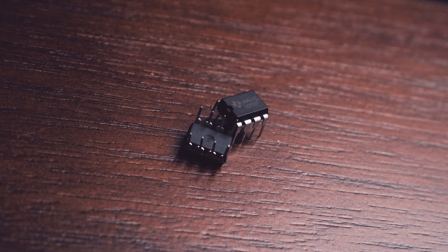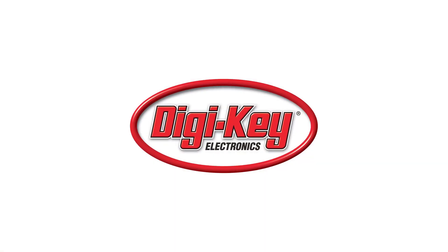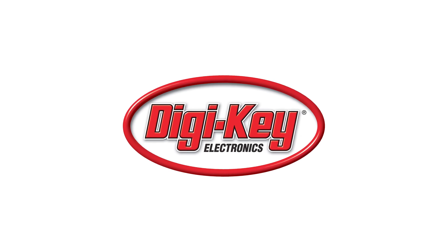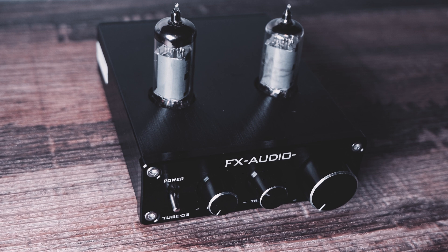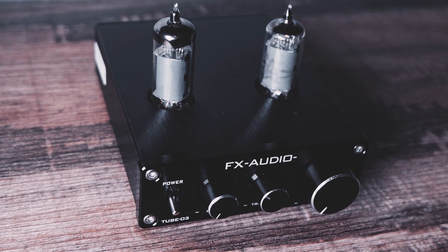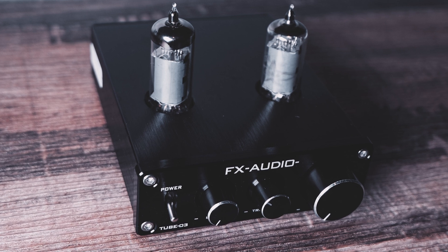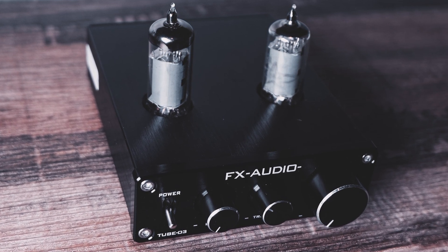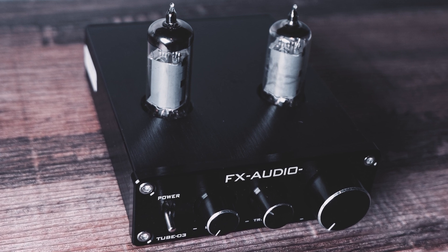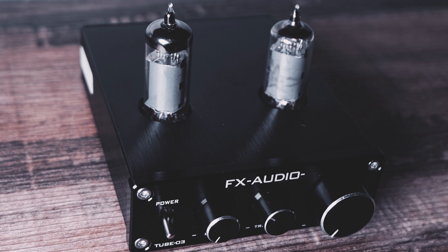I took my friend's advice and looked up a few online on a website called DigiKey. DigiKey has an incredible selection of electronic components such as these. These op amps control the bass and treble of the preamp, so by trying different types of op amps, you could very well discover that some may make your bass and treble sound better than others. That's why my friend Clay from Ran by Monkeys implored I try out different models. For reference though, I am only going to be testing one type.